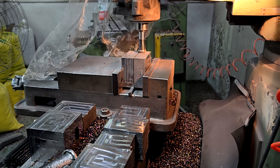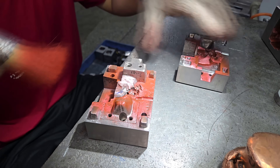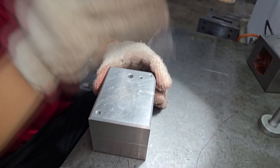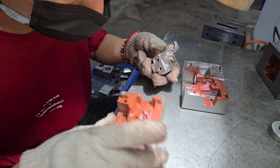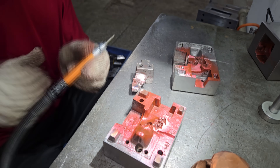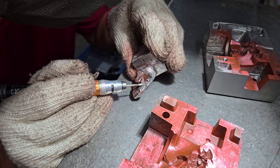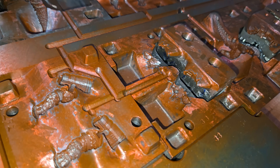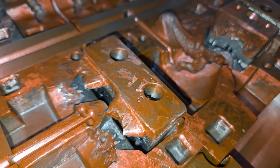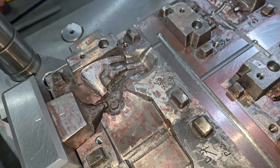Channels are drilled and carved into the blocks for the flow of molten PVC plastic. Now it's time to fine tune the inside of things — the way the blocks fit together and seal is very important. This red color is used to show where the surfaces make contact with each other and where they don't. Precise modifications can be made with a rotary tool or even a bit of spot welding, and they work at it until they get a tight and precise join. Once the team is happy with the fit, the mold blocks can be inserted into a steel frame with a sprue channel and runners for the molten plastic.